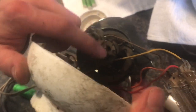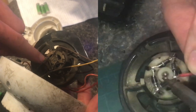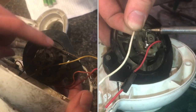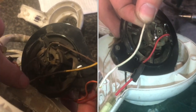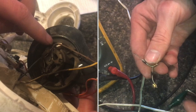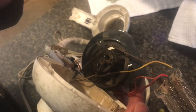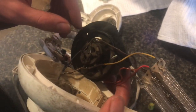You can see the four diodes that form the bridge rectifier. The way it works is the motor tabs connect to two of the diodes, and then on the opposite two connections are where the AC current goes — live and neutral. It doesn't matter which goes where in this case.